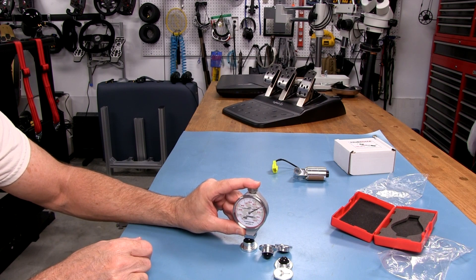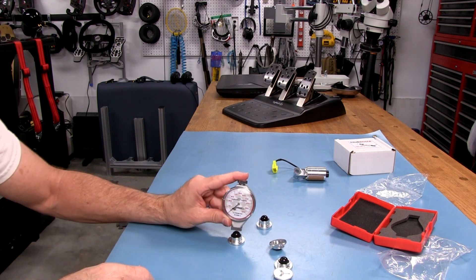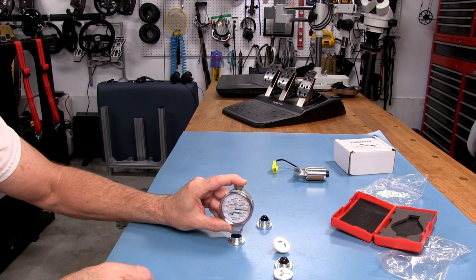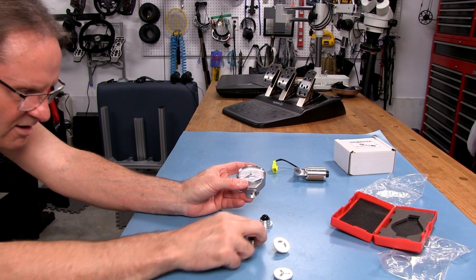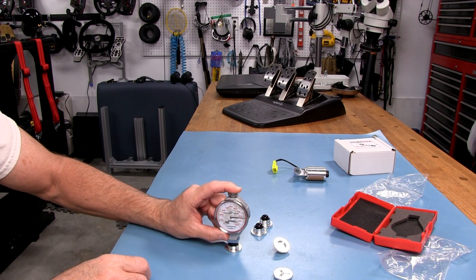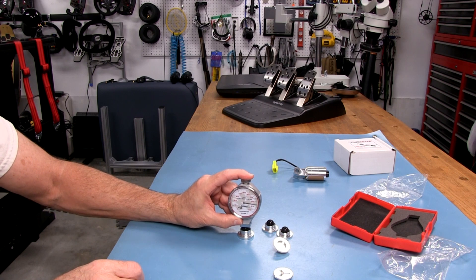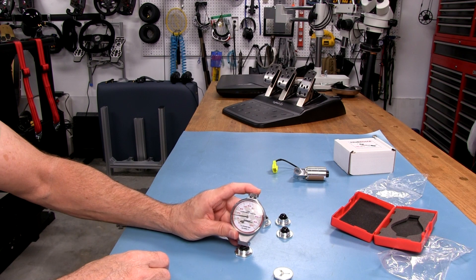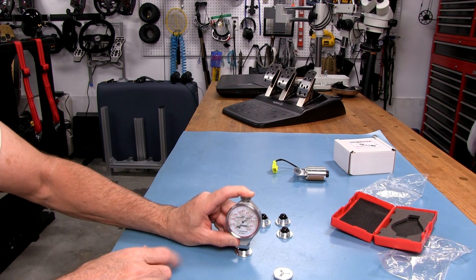Reading around 72 on one and 84 to 85 on the others — they're basically all about the same, around 83-85 shore. The idea is we put one of these urethane bumpers on top of the plunger — what I'm calling the plunger, which looks like it might be Delrin material. This hollowed-out piece fits on top like that, very simple.